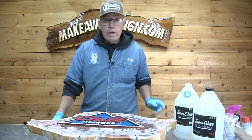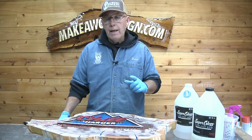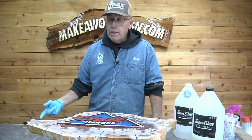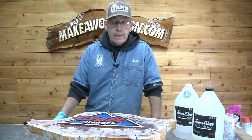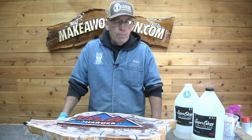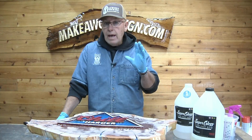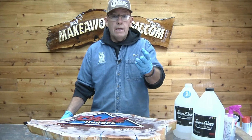All right, so we are going to pour the epoxy, the final flood coat. Now here's what we did. We did the red and the white painting with water-based acrylic, which normally we use One Shot. But the One Shot red really didn't look as red as we wanted, and the acrylic did look the red we wanted. However, with water-based acrylic, we got brush strokes in there. We got 2 or 3 coats on here. We're not super happy with the color, but we think that the epoxy going over the top may blend everything in and look good. Worst case scenario, if that doesn't, then we'll paint on top of the actual resin epoxy finish. So let's get this thing poured.